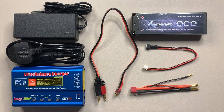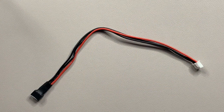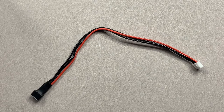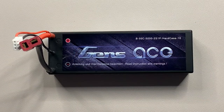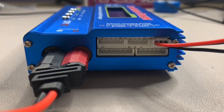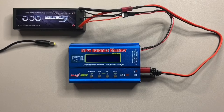Before we get back to the instruction manual, I want to start the battery off charging. I'm not going to go too much through the features of the charger - just what I need it for, which is a balanced charge. I've got a balanced extension cable - one end plugs into the charger and the other into the balance charge cable, giving a bit more distance between the charger and the lipo bag. I've fitted the balance and charge cable to the battery, connected the charge cable and balance extension cable, and now it's just a matter of connecting the battery and putting it in a lipo bag.